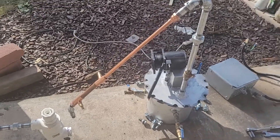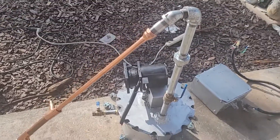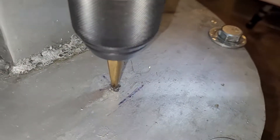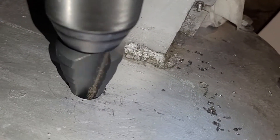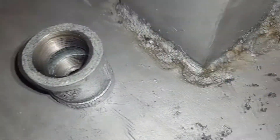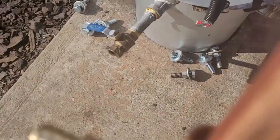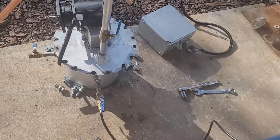So there's just a little prototype — haven't actually put it all together yet because I wanted to show you, but here's what we have so far. The biggest change you'll see is I made one of the outlet ports go to the top right, because in designing this new condensing system it needs to be really high up. I wanted to combine height and width for space efficiency. The taller you get it, the less wide it has to be, and vice versa. So I did a mix of both — I didn't feel like bothering with an elbow that goes up and then back down again. It just makes the most sense to have the gases go up from the start and come down.